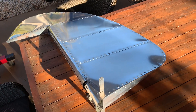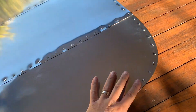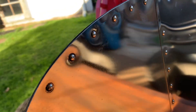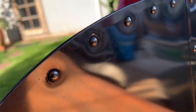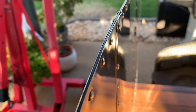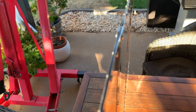It can't be a 'how did Donnie do that' video unless there's something a little different. This is the rudder for Frankenstein and the trailing edge - all solid rivets, eighth rivets. But the rivet tails I've done something different: I've domed them to make them look like rivet heads. So you can see how thick the material is. There's the rivet tail, and I've even gone and put an AD dimple in the middle of the tail to make it look like the rivet head. Why? Well, because I can, and I like the idea of messing with people's minds just a little bit. I really didn't want a shop head sticking out in the breeze on the trailing edge - I just wanted to do something different.